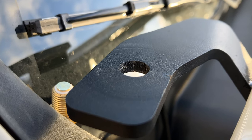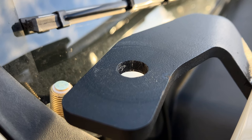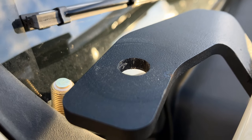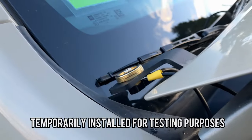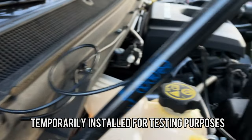This is probably our first big installation mistake. I mounted this antenna to a ditch light bracket on the passenger side of the hood but made no effort to grind away any of the paint or powder coat where the antenna mounts or where the cable attaches to the antenna through the mounting hole.